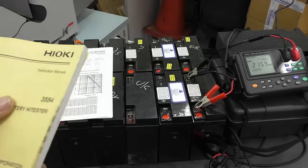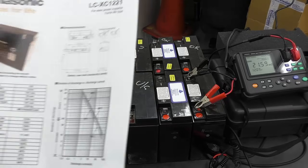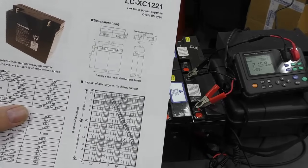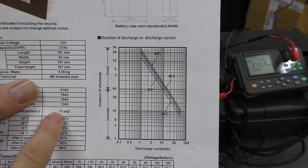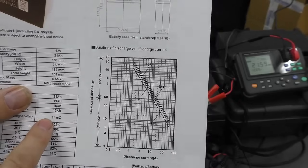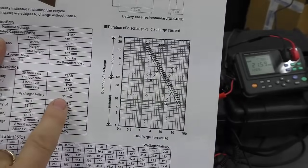What I'm going to do is program up the tester to indicate a fail level so I can go through and very quickly test the batteries. The fail level I'm going to set will be twice this value — so 22 milliohms. Over time one may modify this figure; you may find it's appropriate or inappropriate. But it's a good place to start: twice the internal resistance of a new battery.